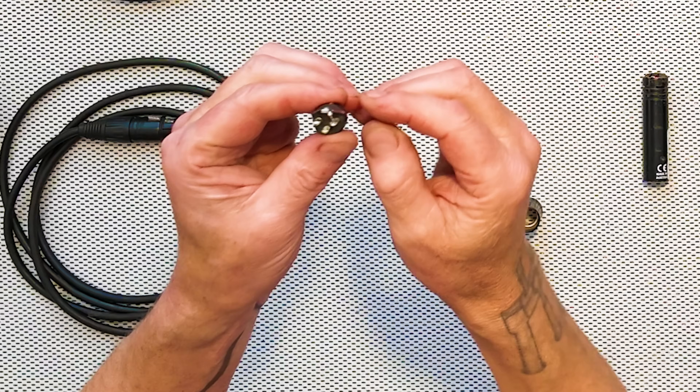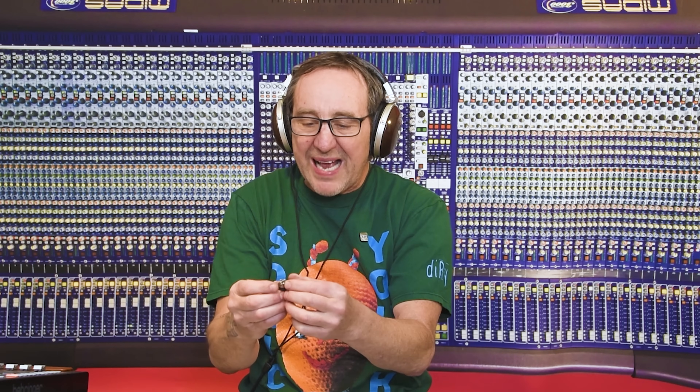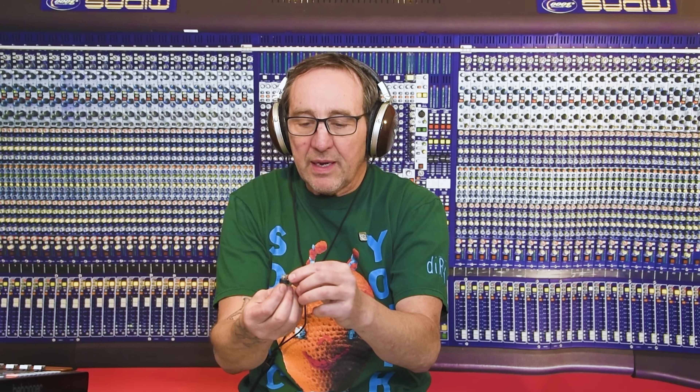What does a mic actually do? A mic not only has its impedance — 150, 200, or 250 ohms — across pins two and three, which stops that noise, but microphones also have a connection between pin one and the housing. All microphones ground the housing; otherwise they would hum or buzz. Here's a connector from inside a microphone — you can see the little wings that scratch against the metal shell, and there's a soldered wire between pin one and those wings so that the shell is always grounded.